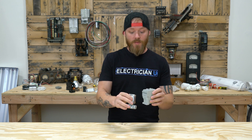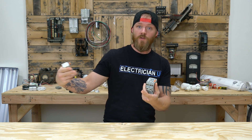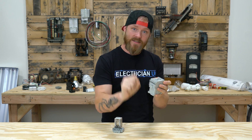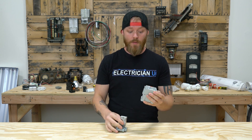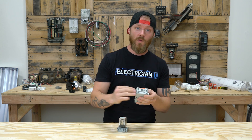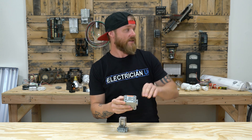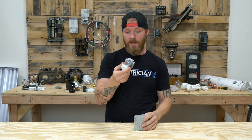Whereas a normal light switch, you can only control one thing. Both of them have coils — there's actually a coil of wire inside that, when you send current through it, engages an electromagnet and it sucks the contacts shut or opens them up. They both operate that way. And both of them have contacts, so they have multiple different contacts that you can run home runs from a panel to, and then run out to the field somewhere.